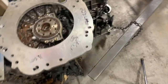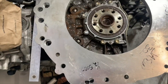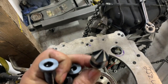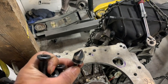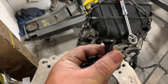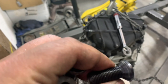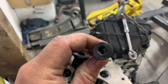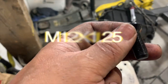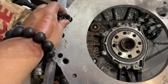Now that I have most of my holes drilled — keep in mind this is not the final plate — most of the holes are drilled out of aluminum. I'm going to countersink them with this countersink, and then I'll be able to use these flat top socket bolts with the angled head. These are M12 by 150, fine threaded metric. I'll tap them and countersink them so they can sit flush.